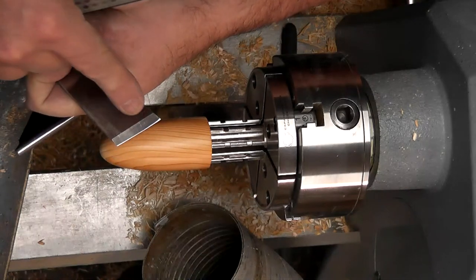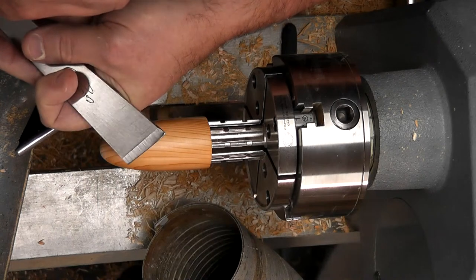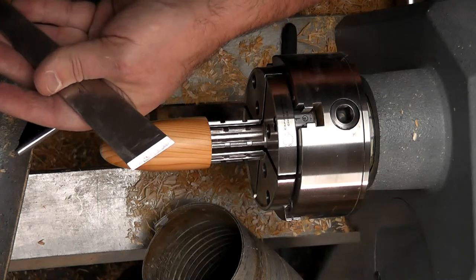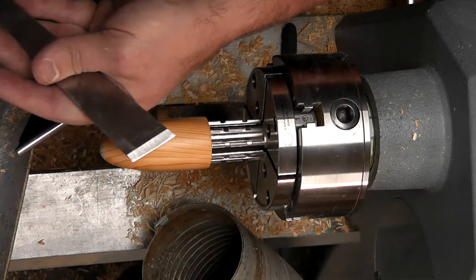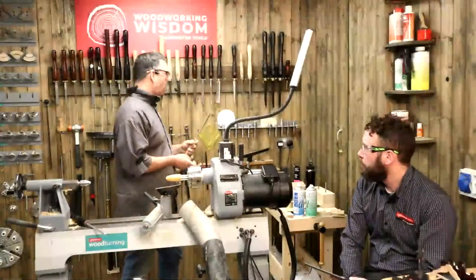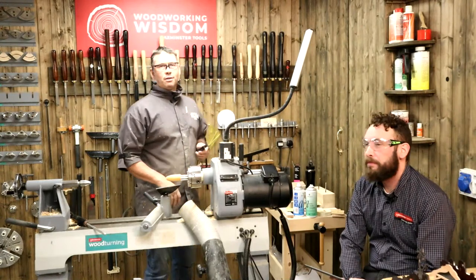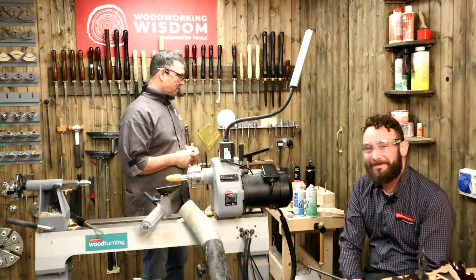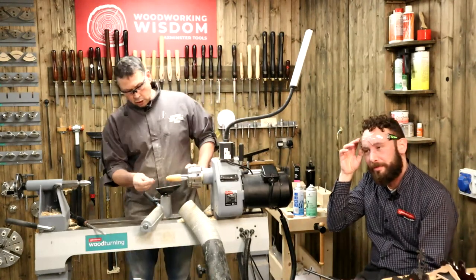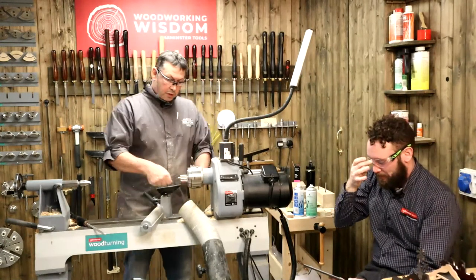Now, a little hone on a piece of leather with some honing soap would also benefit. And I benefit here from the honing wheels on our Tormek. I'll do a lot of honing on these with that. But you can just use a piece of leather. Absolutely fine. No problem at all. And then they'll last you for ages. I've got a carbon steel skew chisel I bought from my apprenticeship. And I finished my apprenticeship a long time ago, '90-something like that. Anyway, so a long time ago, it's still with me, and it's still about 6 inches long. So that's pretty good. There we are. So that's that one. One more to do.